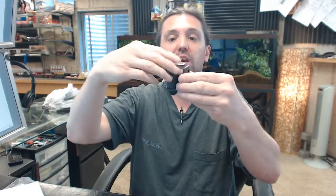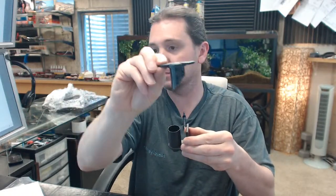Fasten the top pivot. Again, you've got screws for all of that. You're going to do the same with the bottom pivot. Now, visually inspect where your miter is on the cam. You don't want to have to undo this and turn it around 180 degrees. Make sure that you're in this position and that you know where you're installing it.